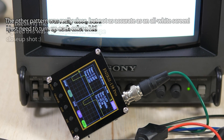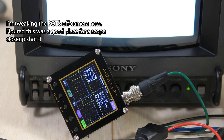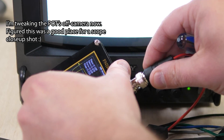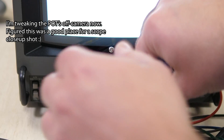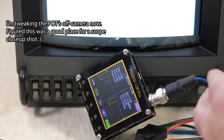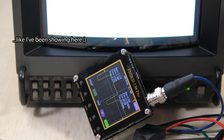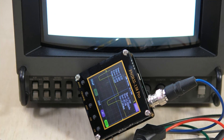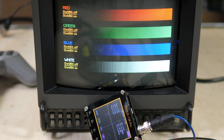A signal that's too bright starts to wash out and lose color information, so even if you turn your display's brightness down, the detail is still lost. It's best to send too low voltage than too much — and of course this is not just about performance, it's about safety. Let's say that color pattern turned out to only be 75% brightness. That means when we calibrate this to 650 millivolts, even the highest brightness the board actually outputs is still probably under the maximum level SCART equipment can handle. You can go down to as low as about 500 millivolts if you'd like to be safe. And while this might still seem like dangerous guesswork, it's much safer than just eyeballing it or not measuring it at all. If one of your arcade boards has a test pattern and the other doesn't, just calibrate it with the one that does. I would set the scope no higher than 650 millivolts — that way if one board is a little hotter, you're still under 714 millivolts, and if one is a little dimmer, you could just bump up the brightness on your TV.